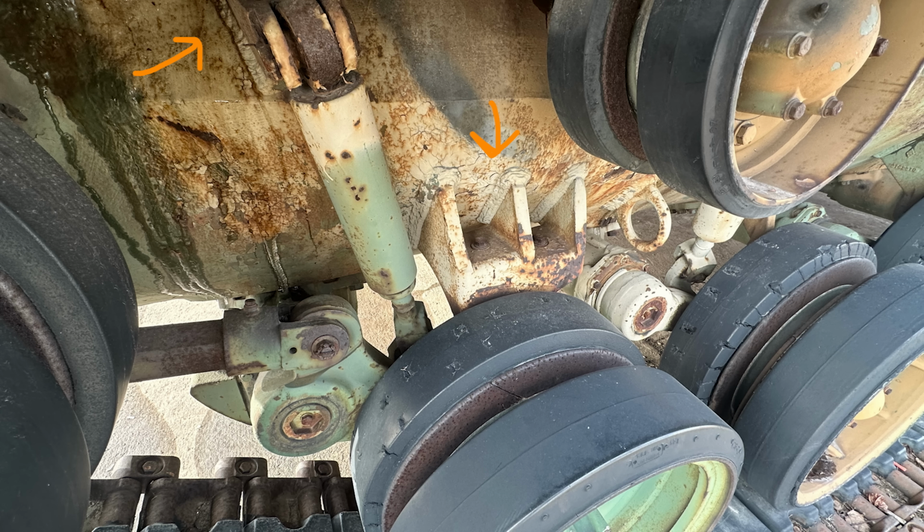Here is part of the carriage and bogie wheel assembly, and everything I saw underneath the sucker really suggested that wire welding was used. Now, based on the weld positions, I believe this was welded upside down and then the whole tank hull was rotated. I do not believe that they welded this vertical up.